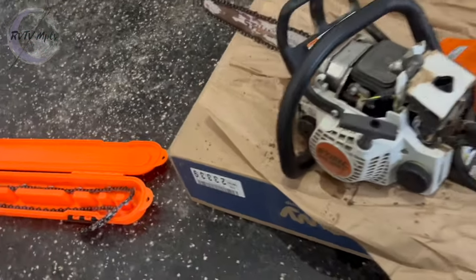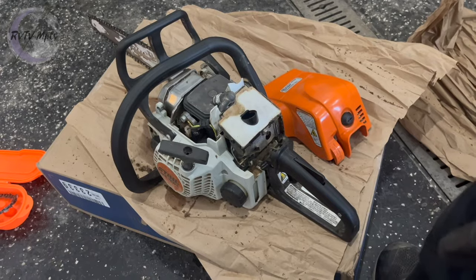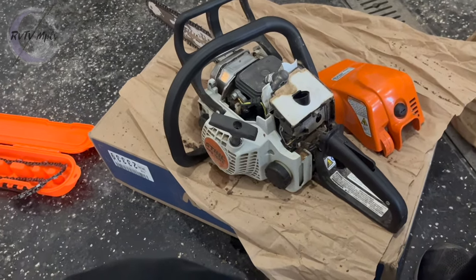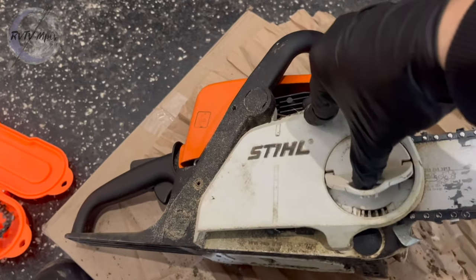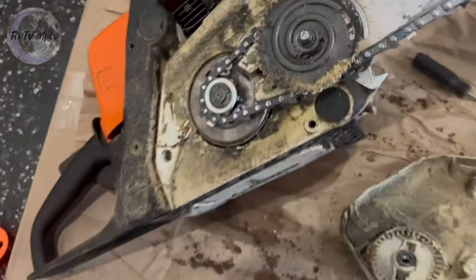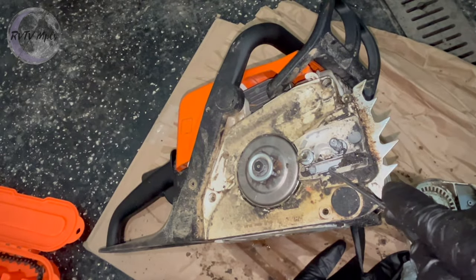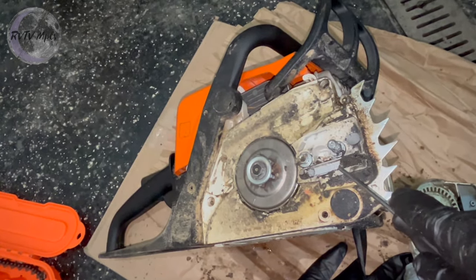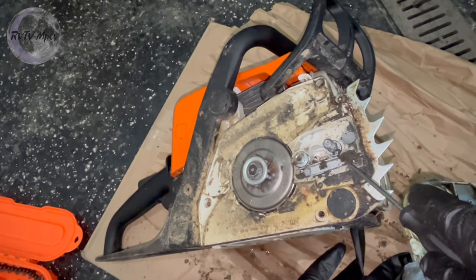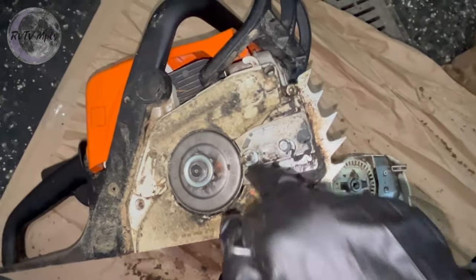Next I'm working on our 180c — this is the smallest saw that we have, the first saw that we had technically. They haven't used this saw since we started buying the other saws. I want to make sure this thing is running tip-top shape because it's actually not a bad saw for doing small work. We're going to throw a new blade on it, clean it all up, and get it fired today. These 180c's are what you call a beginner saw — I really like them. You don't need a tool to pull them apart like you do with all the other chainsaws. You can tell this thing's really dirty, probably hasn't been cleaned ever. The last time we used this chainsaw it just pretty much overheated the blade right away. Now right away we got other saws and I quickly educated myself on the right way to run a saw. You can tell there's a bunch of junk in here — that's the main passageway to oil the chain. We have all this crud built up.